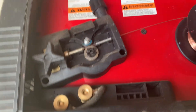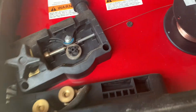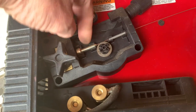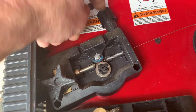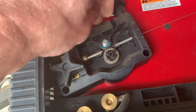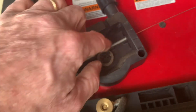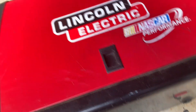You can get away with a little bit of play on your measurements, but you want to get as close as you can, if not exact. When you're doing a new spool, you'd clip it, pull the old wire out, put your new spool in, and then feed it through. You feed it through there all the way up into place and you can adjust your tension on here — this pushes down and grips the wire. If your wire is not feeding right, this is probably too loose. You want it to grip that wire and feed it on through your whip. It's just kind of hand tight, and this thing just plugs right into the wall.